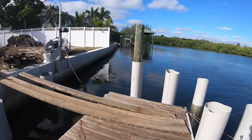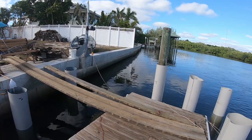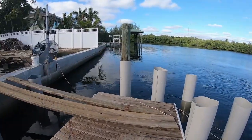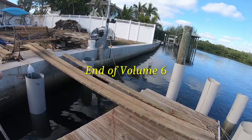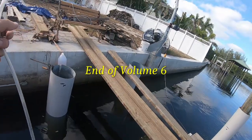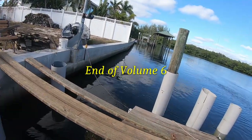And then tomorrow I'm going to very carefully mark around it using a level. And now I know the right height relative to the wall. And then I'll use a level to make the mark around the outside of it and cut it with a saber saw, so that it's nice and clean. And I'm going to fill those with cement and inset the mixed cement, not just the dry like I've been doing, but I'll actually mix up cement, put it in there so that I have a mix ready, and I'll put those brackets in there in line in order to support the rafters that I'm going to be using.